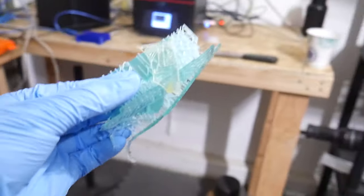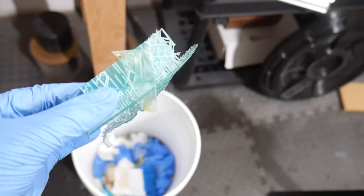And that causes a problem because you need your resin to be low viscosity, relatively liquid and flowing. If it's not flowing, you're going to have adhesion issues and parts are not going to stick to the build plate because it's just too much pressure on the cured pieces and it's just going to peel right off. So make sure your ambient temperatures are not below 70 degrees Fahrenheit. And in the case of certain resins like Siraya Tech Blue and Tenacious, where it's even higher viscosity to begin with, you want to make sure that those are preheated or your ambient air temperature is around 85, almost 90 degrees, in order to print really, really well. Otherwise, you're going to run into issues. And voila, build plate adhesion problems.